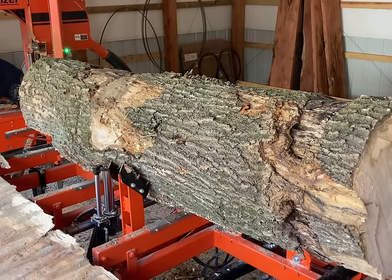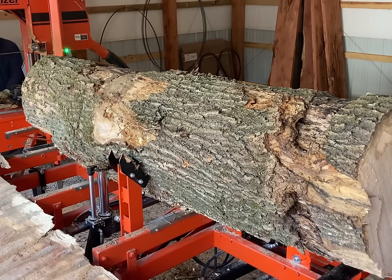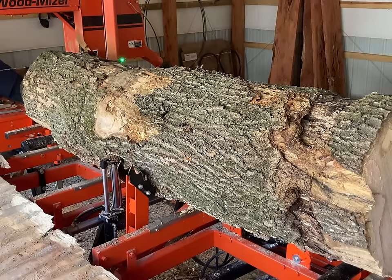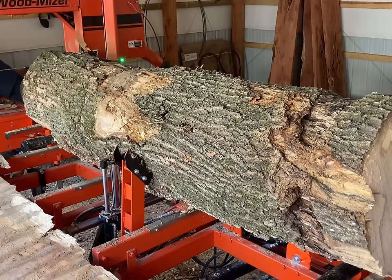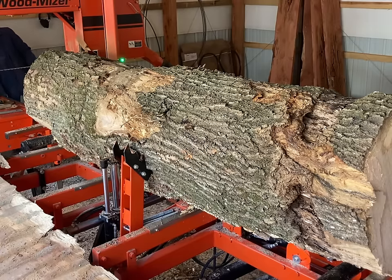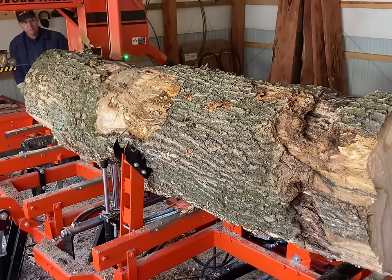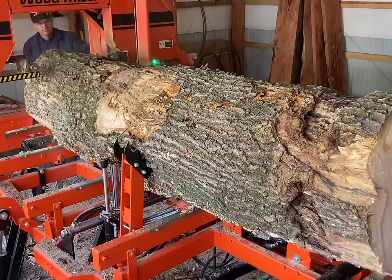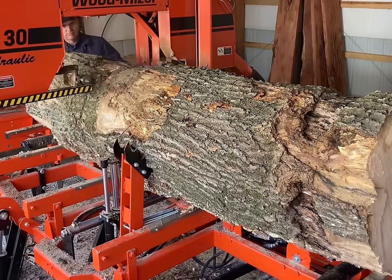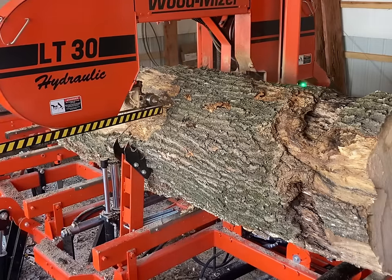The blade I'm using today is a Wood-Mizer Silver Tip 10-degree blade. It is not fresh sharpened — it has cut two or three pine logs prior to starting on this oak log. The plan is to take the four slabs and probably all four fletches off, get this down to a pretty square cant, and then stop and change blades, because every cut then will for sure be in a 20-inch or so thickness. This log does have some obvious dirt and rocks embedded in the crevices in the bark, and before most of the cuts I went over it with a claw hammer and cleaned up the bark pretty well where I'm making the cuts.